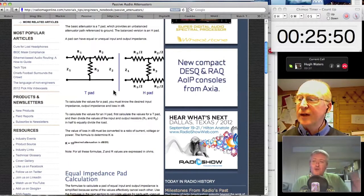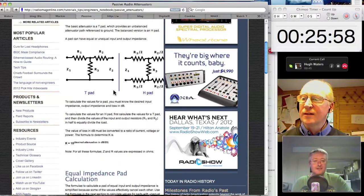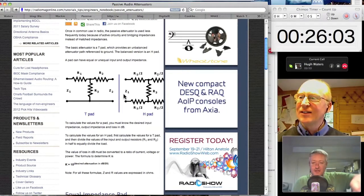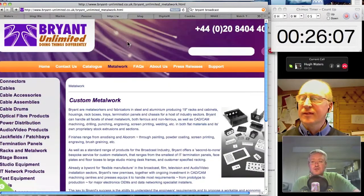And so, yeah, log B 10k pots are just perfect for a passive volume controller, and I've implemented that more times than I care to remember, and it's just fine. It gives a nice range if it's a log B characteristic, and it's just what you need, really.